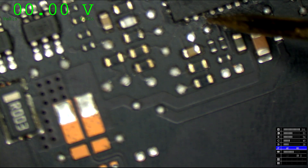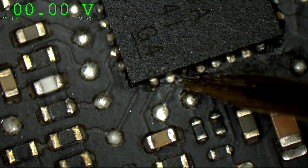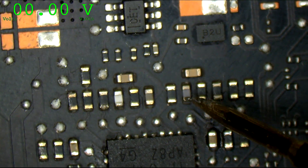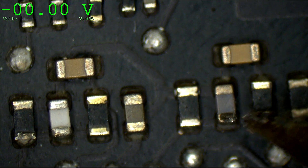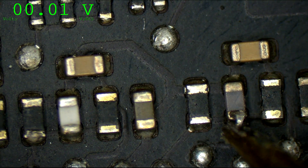This side is flat. This here is a joint on the third pin — this other area is not; that's garbage. Improper soldering could be causing this, but before doing anything I'd like to check for a short to ground. You can also tell that not enough flux was used because the solder is sticking up — all the flux inside had been burned away. You can just chip away at this excess. Remember the adage: the bigger the gob, the better the job. This prevents shitty solder joints clearly caused by not using the proper amount of flux.